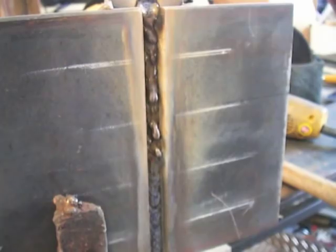For the tie-in: light up ahead of the tie-in and come down into it, then carry on. It does leave some material to burn out but usually that's not a problem unless you hang around too long and deposit a lot of junk. It's good to deposit any arc strikes over an area you're going to re-melt. Arc strikes outside the joint are cause for failure — depending on the strictness of the supervisor, they may or may not let you grind them, but they're often a reason for failing.